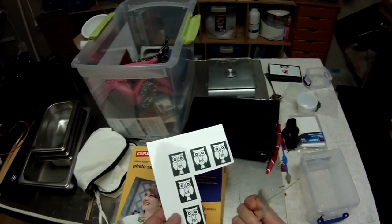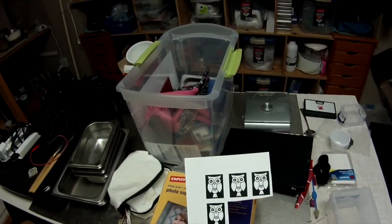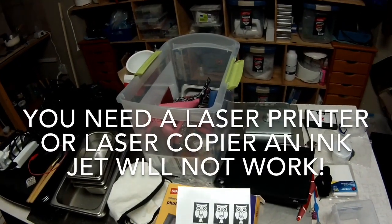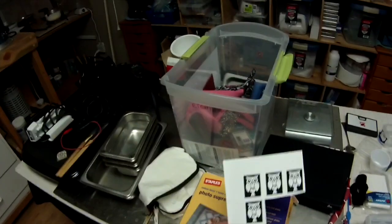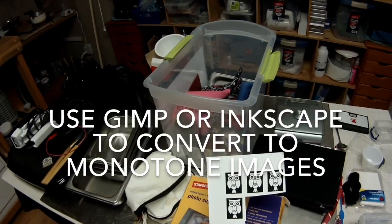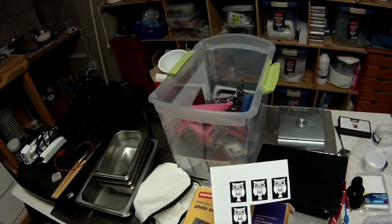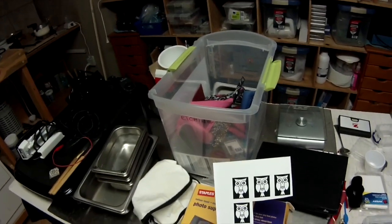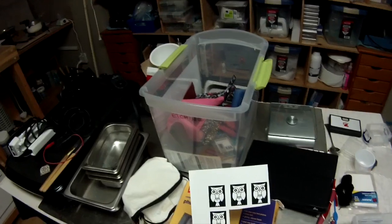You have your sheet of silver, you have your image, and you're going to transfer it over. All three paper options require a laser copy — a laser printer or laser photocopying machine. I download images off the internet and then go into GIMP or Inkscape to convert them into monotone images — that's really important. You do not want a grayscale image, because lighter shades of gray will etch faster than purely black areas. You want pure monotone black and white images.